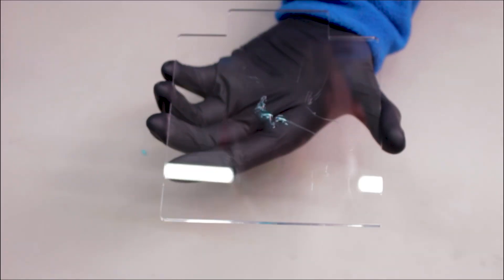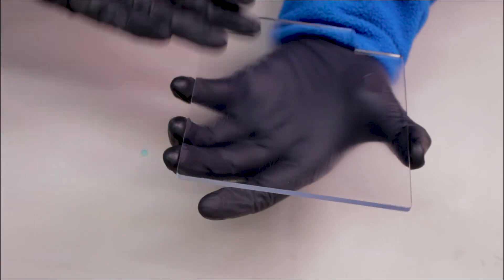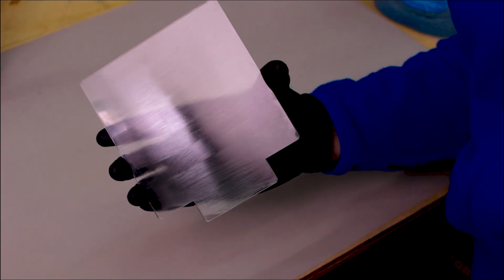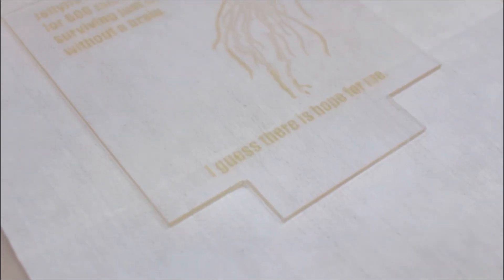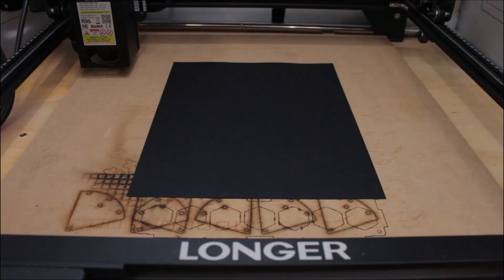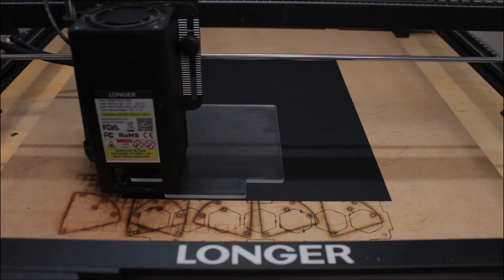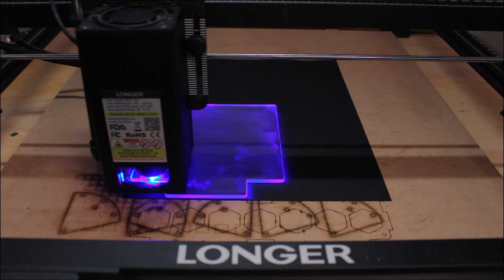Once the acrylic is dry, we're going to use our secret ingredient. We're going to take a couple drops of dish soap — in this case, some Dawn — and rub it into a thin layer on the back. That's going to protect the acrylic from the soot and gunk that comes off the cardstock as it engraves. In testing, when engraving straight onto the cardstock, I end up with brown-black soot in the engraving that no matter how much I scrub I cannot get out. I read a comment somewhere about using dish soap — if you're out there, leave a comment and I'll give you credit. Then we put the dish soap side down onto the cardstock in the laser, line it up, and let it engrave.